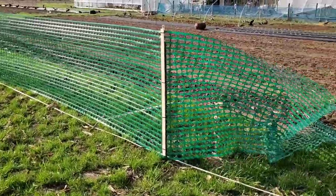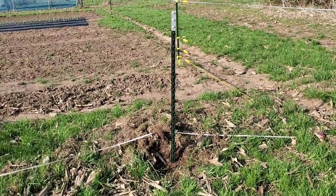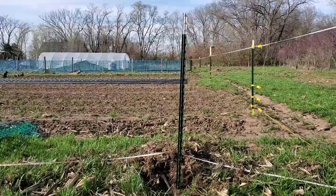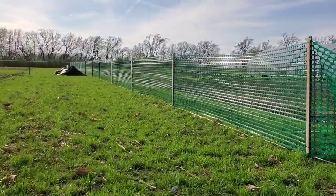Now I've made it down to my last post. I got my extra over here — who knows how long — but I stretch it out and that's about where the last post is going to be. I put it at an angle so it's leaning outwards. That way when the wind blows on it and tensions it, it'll go back up straight. I'll wrap it around twice and zip tie with five: top, bottom, middle, and then two in between. Just a reminder for everybody out there including myself: don't do this when it's windy. It took me about an hour and a half to run 100 feet, and it was frustrating — the wind is constantly pulling on you. Just don't do it, or at least get somebody else to help you.